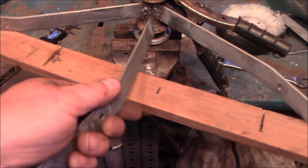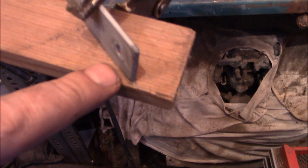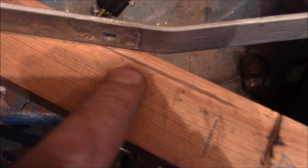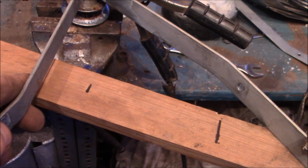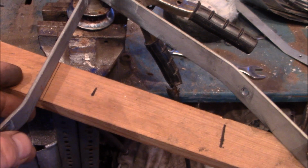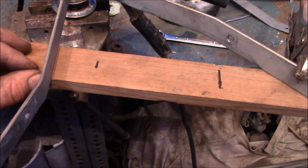Okay, so I'm about ready to weld one of the two broken pieces back in. I've made up a jig, and I know that if that is aligned with there, you can just see the pencil marks around the bottom, and that one's aligned to those pencil marks on the bottom of that. If you look at the pencil marks here, I know if that goes into that slot there and in there, then that's perfectly aligned with all of the others, so it's a perfectly symmetrical wheel. So all I need to do is line up the holes, and I've basically just drawn those lines off these three. I clipped it between that one and saw where that one was lying, and then I've checked it here and there, and I know that this is right now.